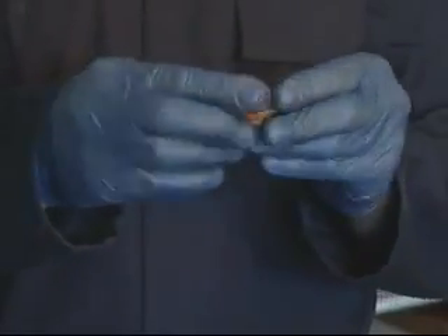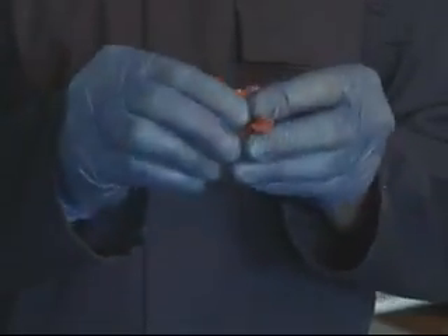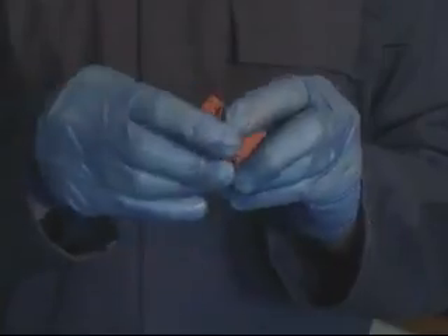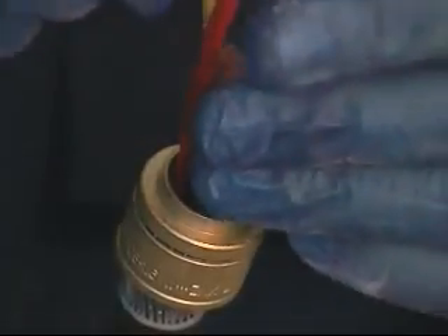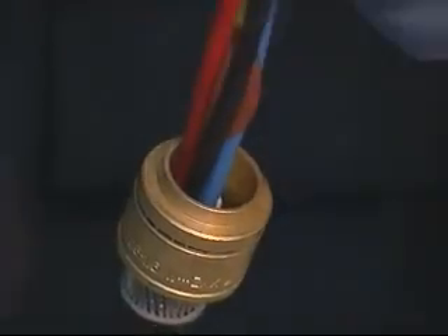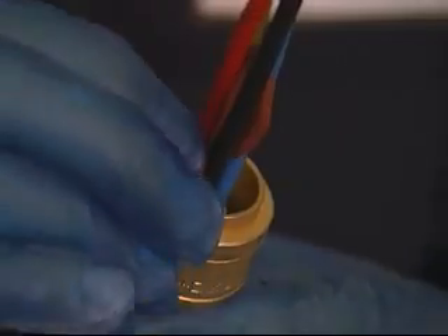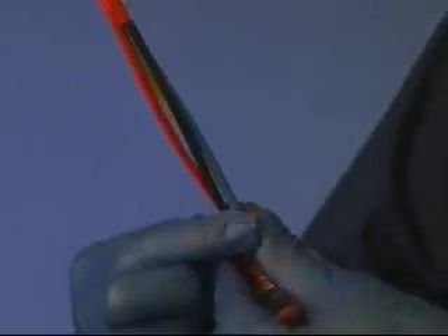Mix the compound found in the two plastic bags until they blend together into one solid colour with no streaks. Once mixed, apply to the conductors within 30 minutes as after this time the compound will begin to stiffen as the curing process begins. Spread the cable conductors apart to enable the compound to be packed into the crotch of the cores. Close the conductors together and bind the ends with tape. Apply compound around and in between the cable conductors extending no more than 35mm up the cable.